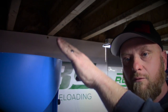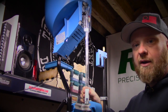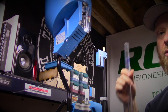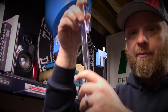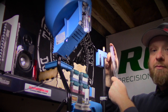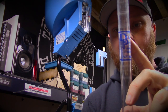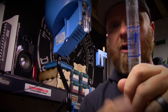Continuing down from the top to the bottom on the case feeder stuff. We need to access this adapter sleeve for our case feeder. I'll take this tube off — it just pops out of position. An important note: when you install this, make sure the Dillon label is at the top. This end has a nice chamfer on it; the other end does not. If you put it in upside down, you're going to get cartridges hanging up in your case feeder. Dillon's put an arrow here to indicate which end goes up — don't forget that.